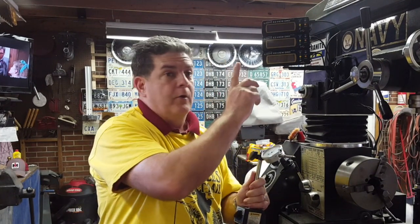So what we're going to do today, guys, is we're going to take this dial indicator and I'm going to put it directly on the sensor itself — not on the table, but on the sensor itself. So after we get it set up and mounted, we're going to get the camera on the digital readout and another camera on the dial indicator and compare the difference between the two when I turn the knob very slowly in one direction.